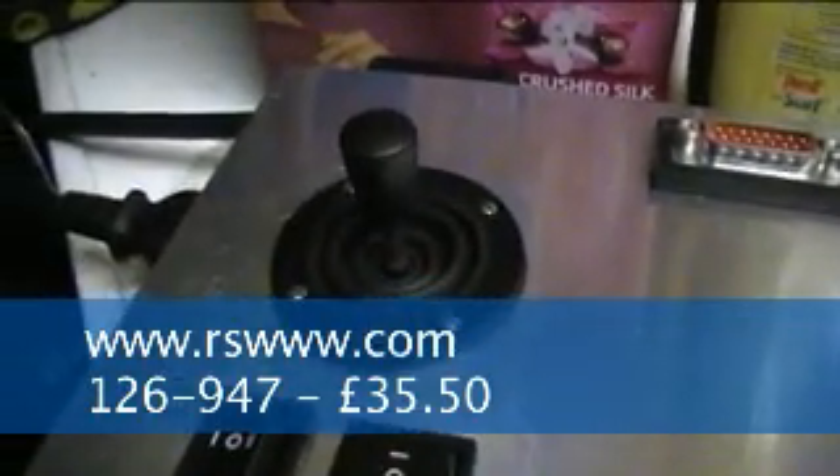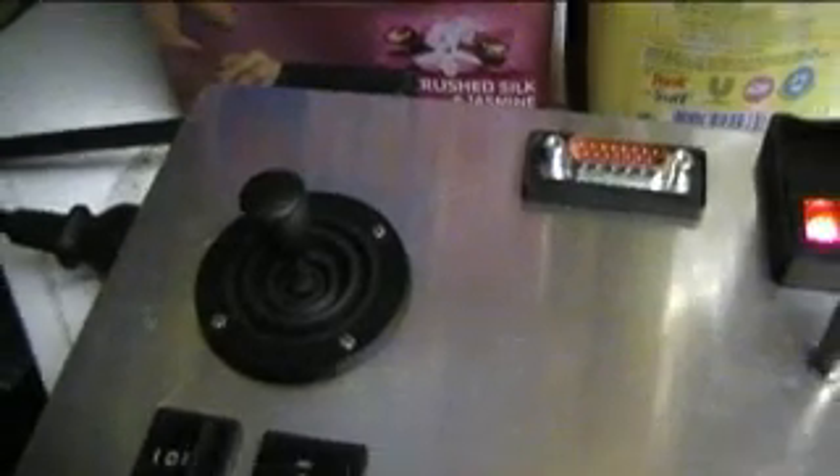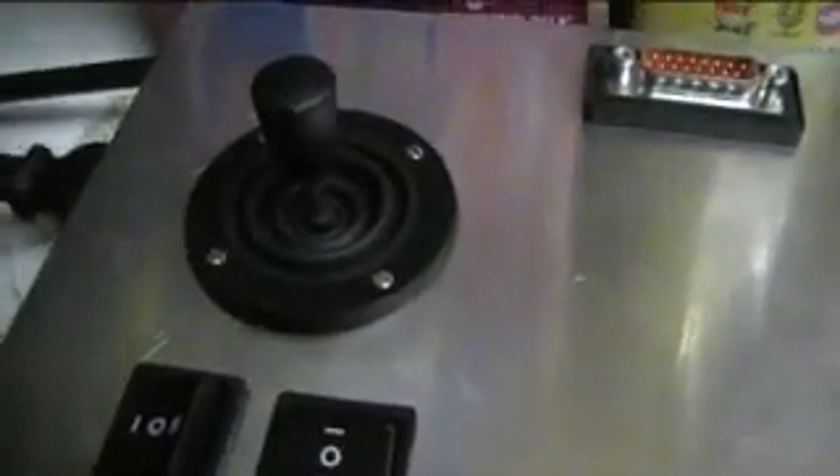The controller inside here — as I mentioned — is the AX500 from Active Robots in the UK. The joystick is an APEM 5000 series, which is a stick that directly manipulates two 5K potentiometers. You have two extremes: zero volts and five volts, and the middle is two and a half volts. But because it only goes from about three volts to two volts, the controller board is looking for five to zero, which is a pain. Cosma, who designs the controller boards for Robotech, has designed beta firmware you can install on the controller which lets you change those parameters, which works out quite nicely.